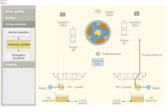Consider during the operation there is a fracture in one of the pipes. The oil starts leaking and oil level starts dropping in the oil reservoir. The low level alarm is raised. If the leakage is severe, then low level alarm sounds and auto isolation takes place in the following way.